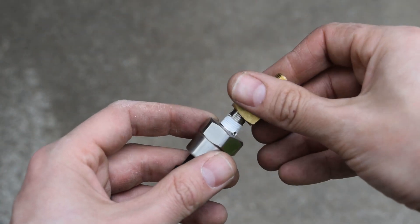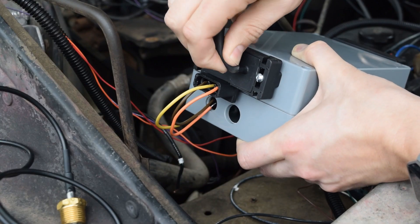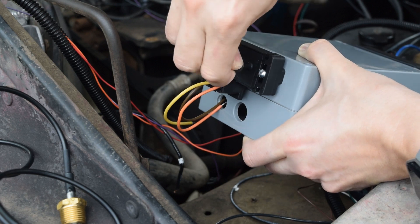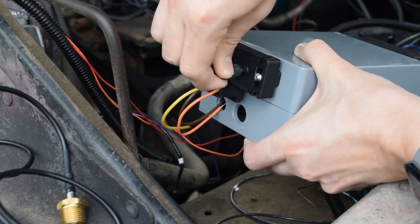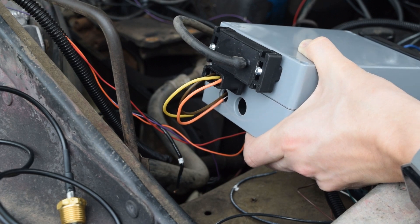T's can be used to add locations for pressure sensor installation. The manifold vacuum boost sensor is located on the outside of the one gauge hub. To provide vacuum to the unit, run a rubber vacuum hose from a manifold port to the sensor on the hub.